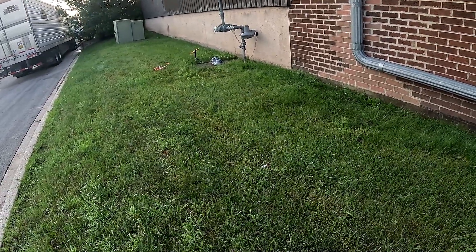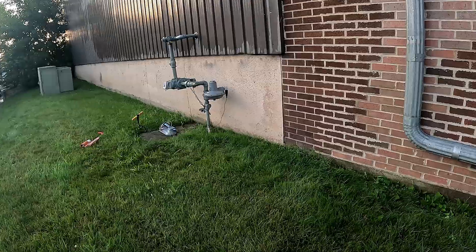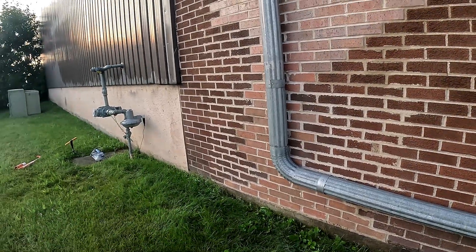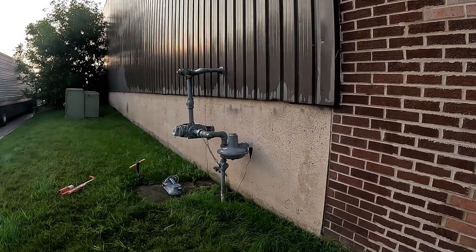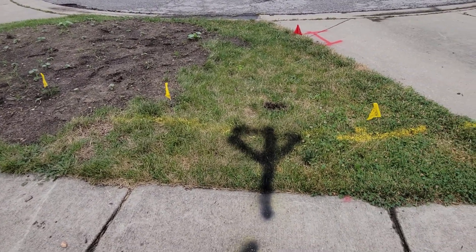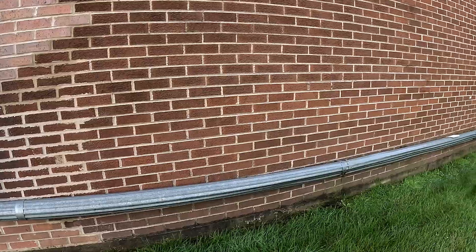That's how damage happens because someone wanted to locate off the vent, and that's not the right way to locate a gas service. This meter is a big meter — this is big time. That's probably taking one pound of gas coming in. So it's very important not to locate off the vent. There might be times you get lucky and get a tone, but it's not good practice. I showed a video a couple months ago about a gas service that got miss-marked because the locator went above the regulator and bled off onto the water main.